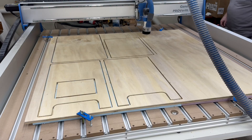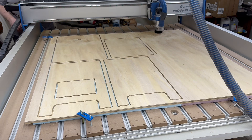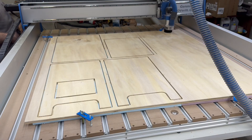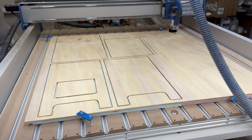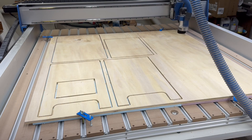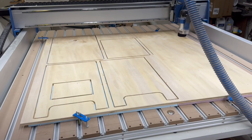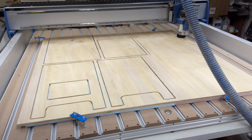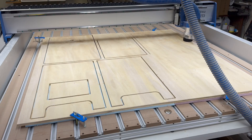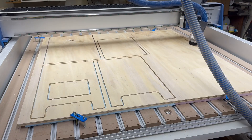You can also see that the four clamps work just fine cutting this material out. I'm using the dust collection and there is virtually no sawdust at all, so it's a very effective system. In the future I'm going to build a boom to hold the hose above the CNC machine, but for right now I'm just using an old coat hanger hooked on the ceiling with the hose attached to it — it works, but it's certainly not pretty.